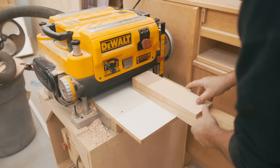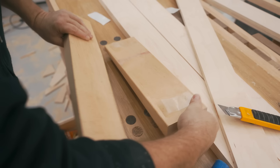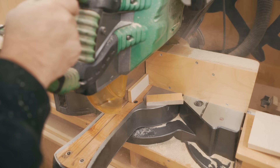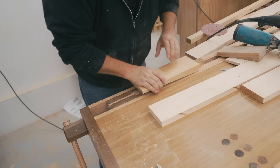And yeah, that's what he's doing. You can pop those apart, pull off the tape, and trim the ends again because he left them a little bit long to deal with snipe. And now he's flipped it over and made this cut specifically like this because it needs to be 90 degrees on the end where it goes up in the corner. And to go even further with the look, he made another one — a smaller one. Here you can see he's got that put on top of the other one to make that cut. That end cut needs to be at the right angle because these two are going to be installed together.